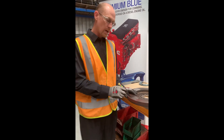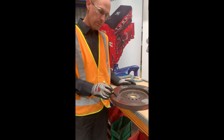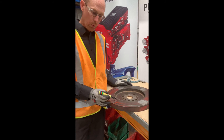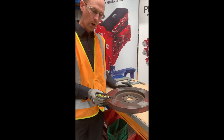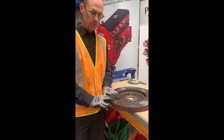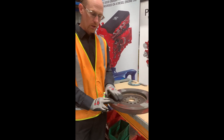Now we've taken our eight measurements around the vibration damper. On this particular damper, we've got a highest reading of 0.27mm and a lowest measurement of 0.08mm, giving us a 0.19mm variation. This is within the reuse guideline specification of 0.25mm maximum deviation between your highest and lowest reading.